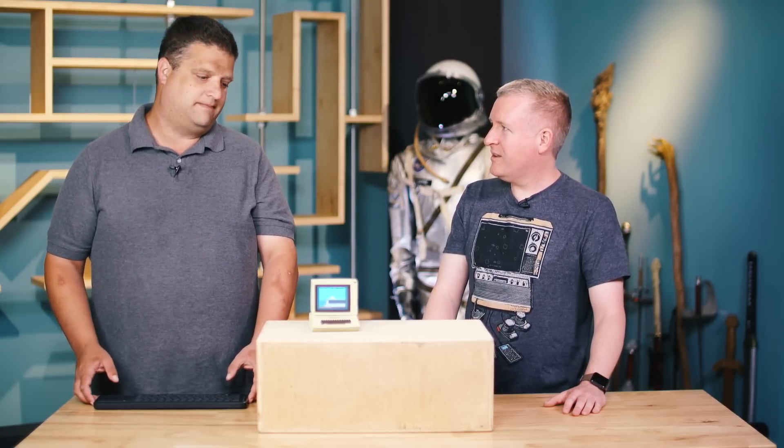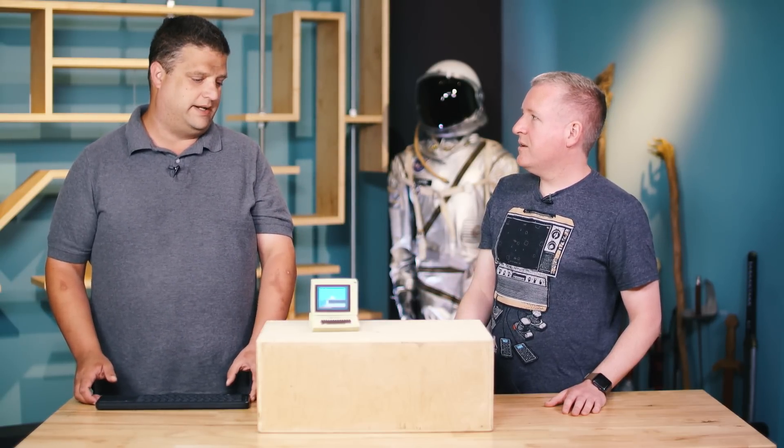Can you play games on it? It plays games just fine. It makes sound? I put a speaker in it. It's all self-contained and runs on a drone battery — a 12-volt battery, about 1900 milliamp hours. In this configuration I feel like I should get about eight hours out of it. You did some custom circuitry then? I built a custom PCB to handle the power distribution and bringing the audio to a little speaker, which helps make it more compact.